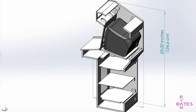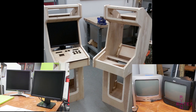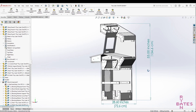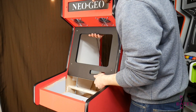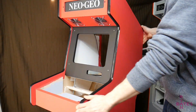If you cut all the interior panels to 15 inches wide, which is what's shown here, this cabinet style and proportions can fit either of two types of monitors: a 13-inch CRT or a 17-inch LCD. Either display can be accessed from the rear of the cabinet for service or replacement. You can also change the monitor bezel if you want to switch the monitor type at any point in the cabinet's lifespan. Versatility is key here since we are relying on old monitors that may not last forever.